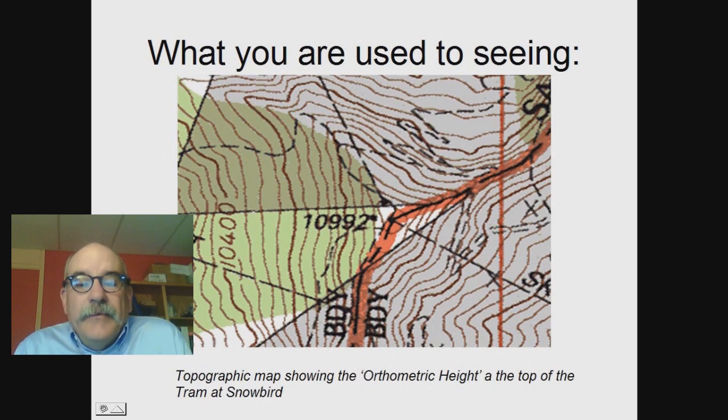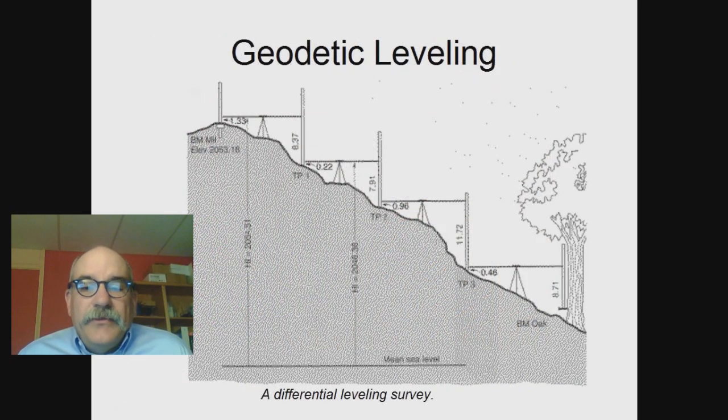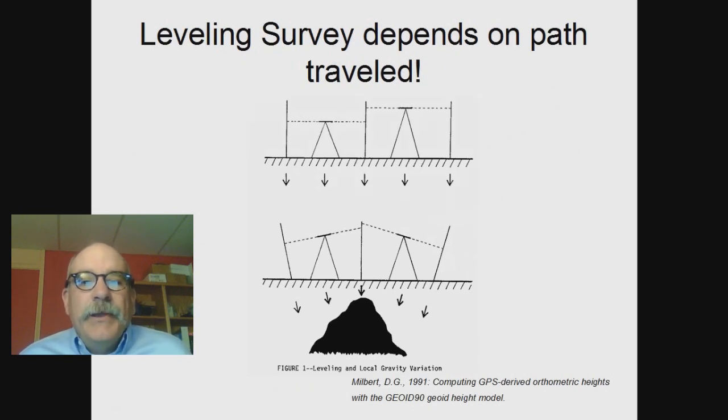These are the heights you see on road signs when driving around the country. If you pull the cover off a vertical monument that the NGS has set and look up the datasheet, it will list an orthometric or leveled height. The way these orthometric heights are determined is we find a mean sea level — someplace in San Diego — and then run a precise leveling loop from San Diego up to Salt Lake City. This loop is comprised of making a bunch of short little jumps with two staves and measuring the forward and back elevations. There's a problem introduced: the apparent level depends upon the path traveled, so if we travel over an area of local high or low gravity, that mass underneath the Earth will cause our leveling instruments to be slightly off.